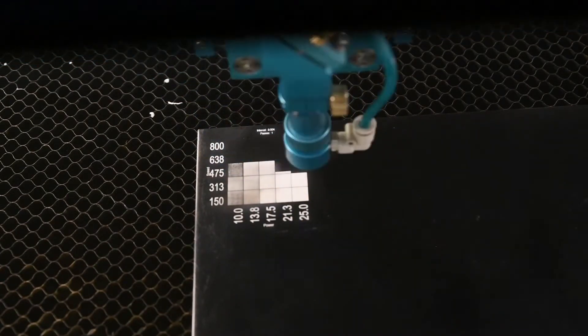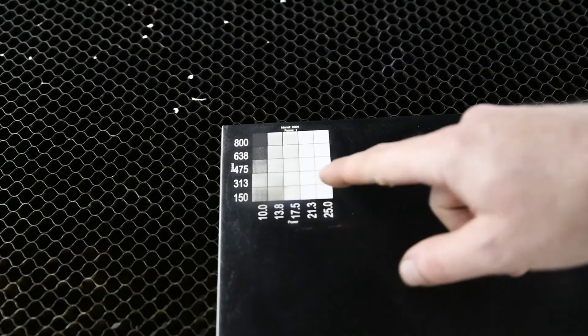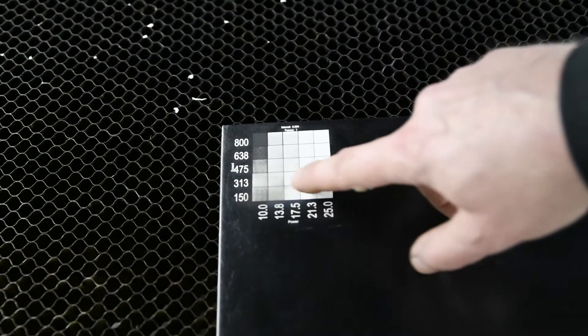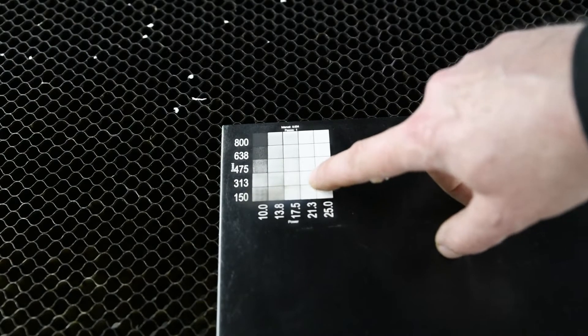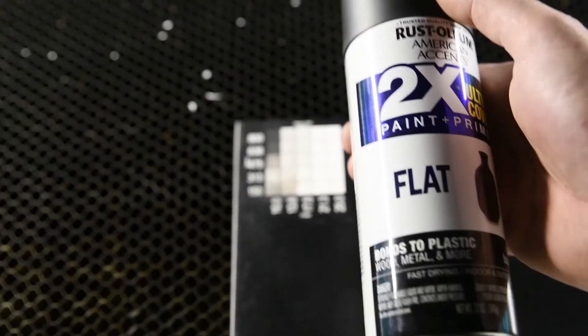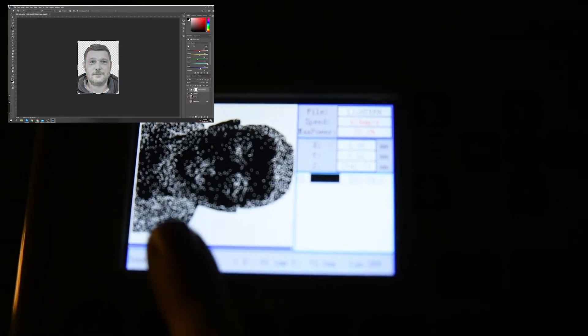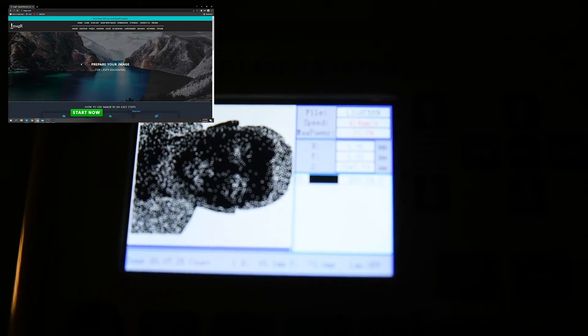That's framed up in the laser and I'm going to send that now. Looking at the results, anything over 25 power I'm not going to use, and I'm not going to run it too fast. I'm going to go in between, so about 250 speed and 23 power — that should clear out everything I need. The paint is Rust-Oleum two-coat flat. I just wanted to show: 250 speed, 24 power, and that's how the picture looks — it's inverted. I'm going to start that now.